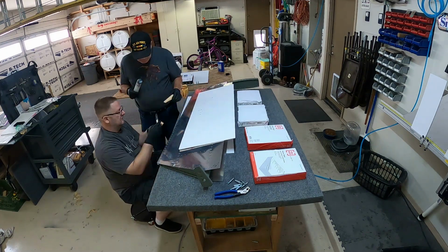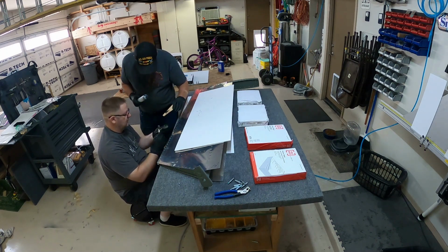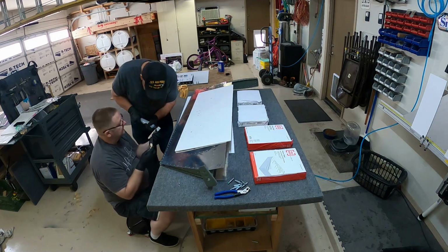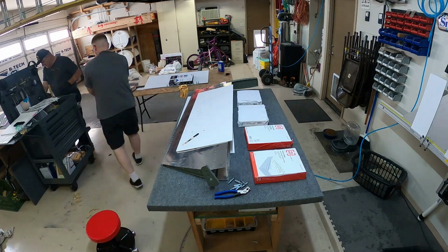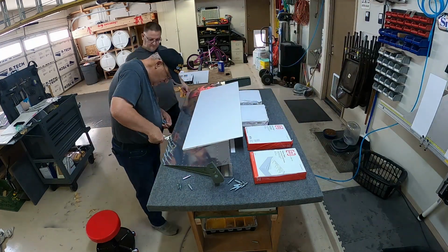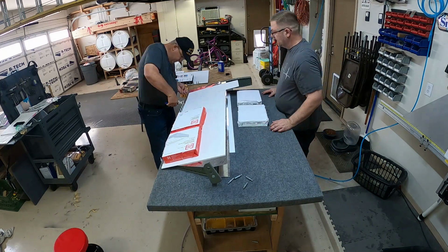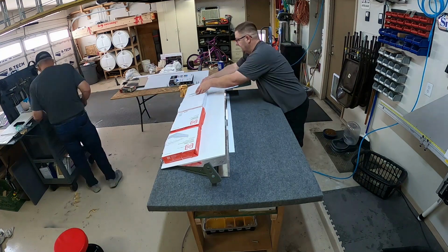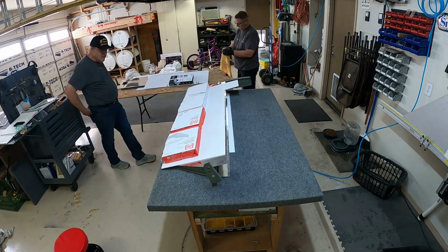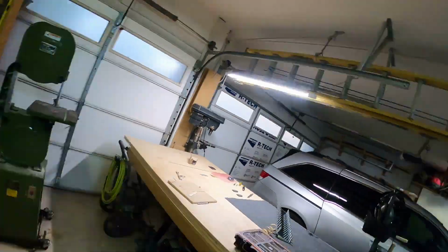So I would definitely purchase the nozzle that goes on the end of that tank sealant tube, and then all we're doing is spreading it out. It says to put it like a 1/16 of an inch thick on the edges, so my dad puts a little glob of it there, and then I spread it out with a popsicle stick basically, and then we slide them in their spots, cleco the trailing edge together, and then set some weight on it to hold them down, and they ended up gorgeous. I mean, they are pretty, so it was kind of nice. We did go through a bunch of gloves and rags for that.